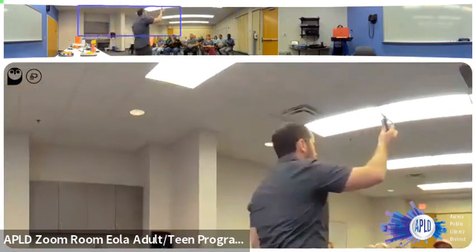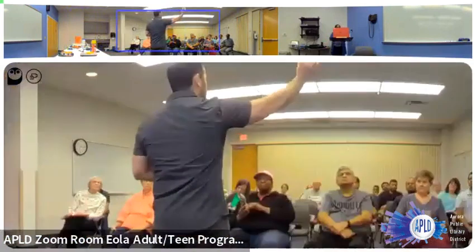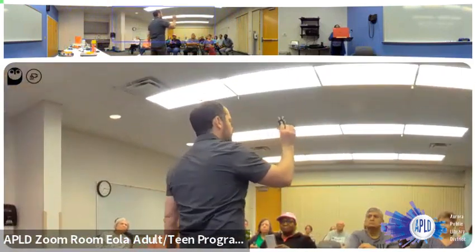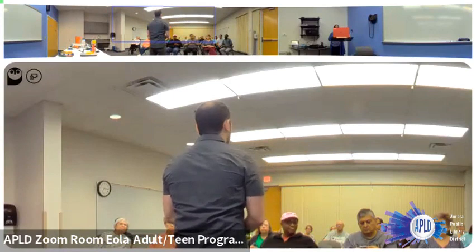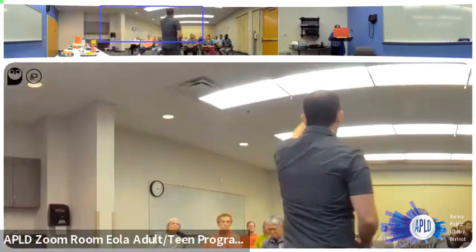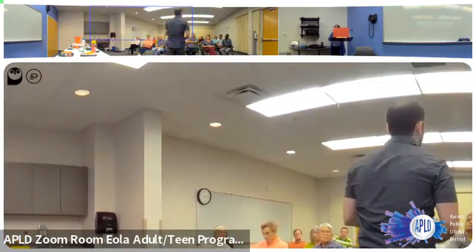outlets are just a few screws. Okay? This is what you see. You take this screw out, this is what you see. You take these two screws out, you get access to the sides. The wires go right here. You take those screws off. You get the shiny new one. Those screws in reverse, okay? The whole job takes about 5 minutes, okay? Then you can turn the power back on.